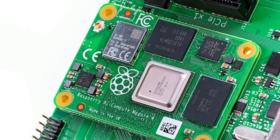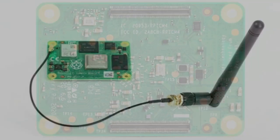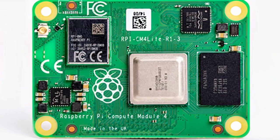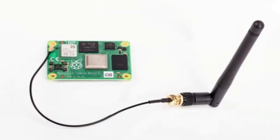There's also a Wi-Fi antenna kit. You don't need the Wi-Fi antenna for the compute module, but if you are putting it in an enclosure — especially a metal enclosure — you're going to want this antenna, because first off it's outside and it'll get you better range. Also, it's certified with this antenna. And it's only about five bucks or so, and you get the UFL connector and the antenna. What a deal.